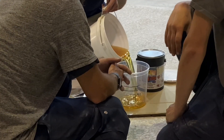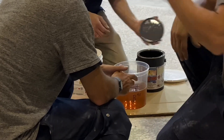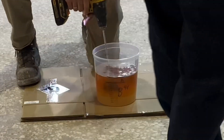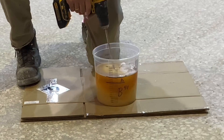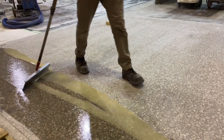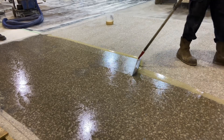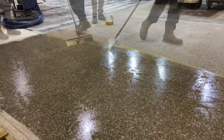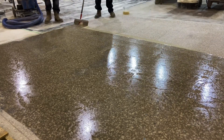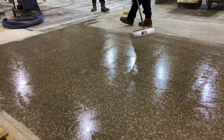The primer coat is next. This is usually done with a primer made for direct-to-concrete placement. The product used here is a water-based epoxy — a two-component product that's clear or can be pigmented. It's applied by drywall taping blade to fill the slab's surface pores. It's not meant to fix or fill voids, which would be better treated with a patching product. One purpose of the primer is to fill the pores and act as a mechanical system anchor. Another is to seal the slab's surface so the next layer's thickness remains uniform.